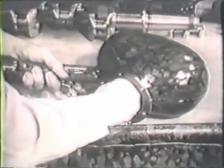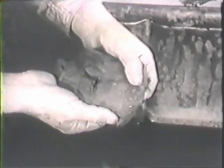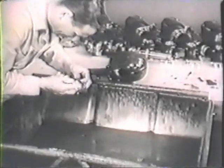Before cleaning the oil sump, make a careful search for metal particles that may have chipped off the engine. Wipe out the inside with a clean rag. Loose particles of metal might be a clue to serious trouble in an engine. If you should find any chips like this, determine the kind of metal and look for the cause. Clean every part you've disassembled with equal thoroughness.